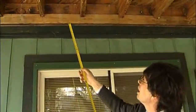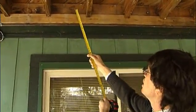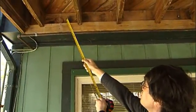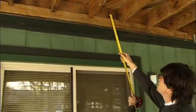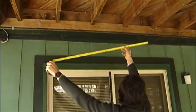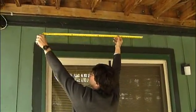The ledger board is attached with nails at this location — you can see three nails — and we see a couple of bolts. For example, there's one bolt here, and then I look all the way over to here before I can find the next bolt. I measure that, and it's approximately 48 inches between these two bolts.